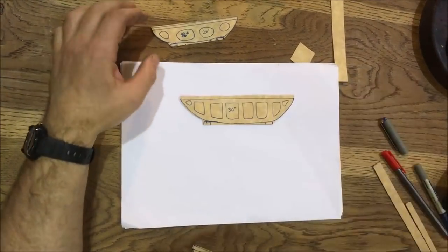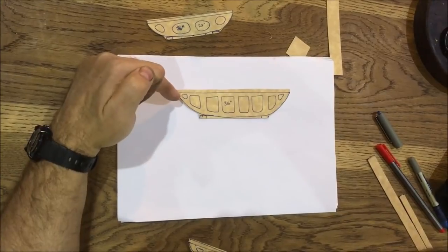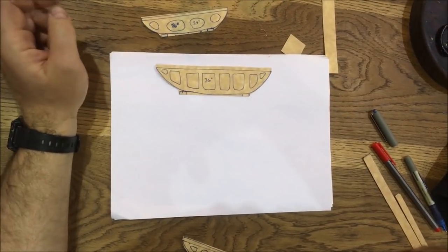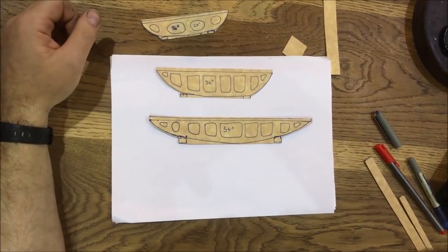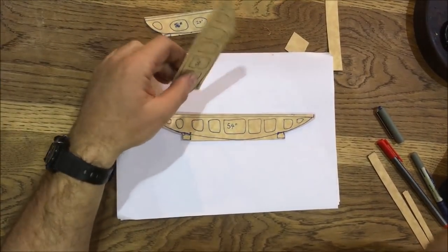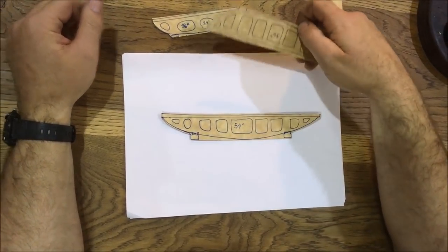I then use the 24-inch plate to produce a flat plane by step printing the 36-inch straight edge, which is, to the best of my ability, as good as I can get. And what we're trying to do is a 54-inch. So theory would say straightforward, you print it, and then when you've got that bit flat, you print that bit.